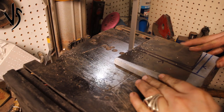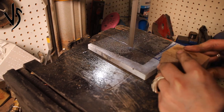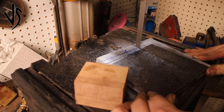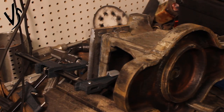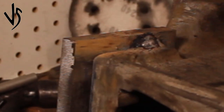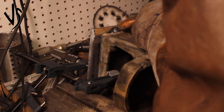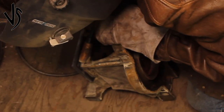Instead of just welding that spot of the dead plate, I'm taking a piece of half-inch plate and welding that to the face, giving me a nice solid block to hit upon. It won't be a true anvil — it'll just be a dead plate — but I have an actual anvil in my shop; this is for some small odd tasks. I was wondering how well this thing would weld since most of this piece is cast, but since I'm not going to be putting a lot of prying pressure on it, I'm not too worried, and the weld did penetrate and take very well.